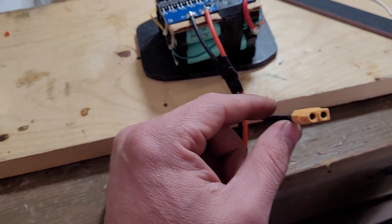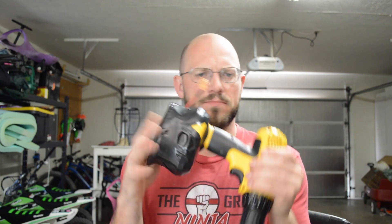We'll have our charge wire which will just be kind of flapping in the breeze — whenever we need to charge it, we'll just plug in our charger. The BMS has been finished, we soldered it on, and all we did was tape it to the drill. Works great. I've got a charge connection just hanging out here. I went from a 4.7 amp per cell that didn't work at all, to a 30 amp 2000 milliamp-hour cell that's going to work really well. I'll do a more permanent fixture when I get some larger shrink wrap, but that's not coming for another month and I wanted to be able to use this. See you guys later, thanks for watching.